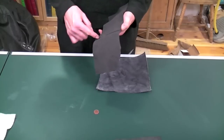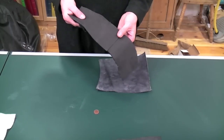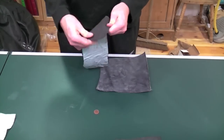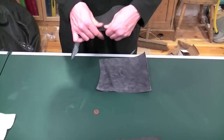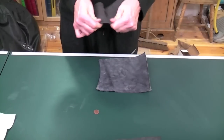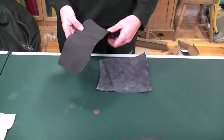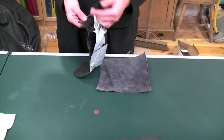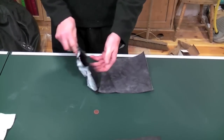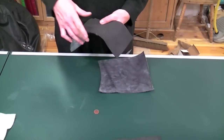This is the only one which comes with a welded joint. This is heat welded with a hot air gun because we don't use naked flames on building sites anymore. This one is also reinforced with some glass fibre strips. If I do this, you'll hear me break the strips — okay, so that's the glass fibre inside breaking. But we break that sometimes if we need to stretch it up or around a particular detail. This one is sticky back — we put a primer on the roof and this just goes down and we stick it to it. Once the primer's there, that doesn't come back up again.